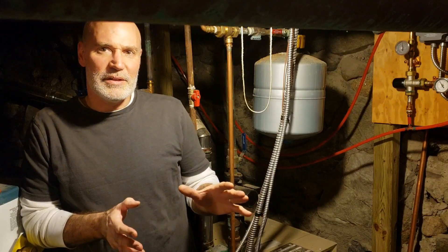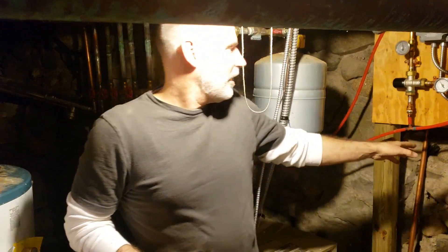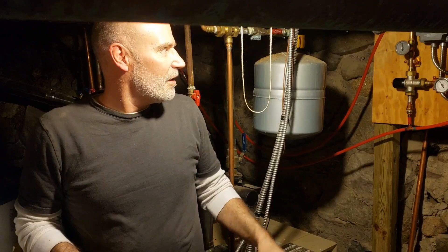I'm just getting tired of doing that, so we're adding thermostat controls to five of my seven zones. One zone is always on and still too cold, so a thermostat doesn't make sense there. The other is a dining room addition with in-floor heat controlled by a mixing valve circuit, and that room is open to two others already being controlled by thermostats — adding one there would be overkill.